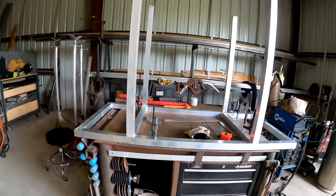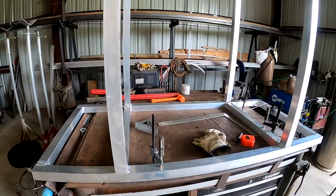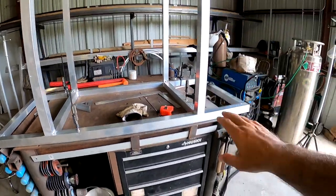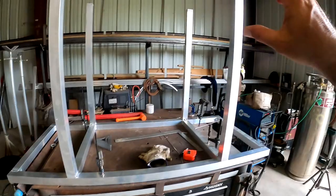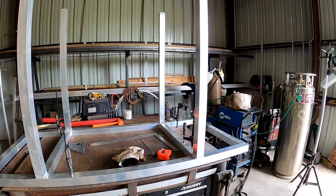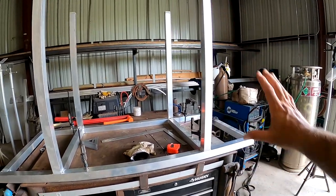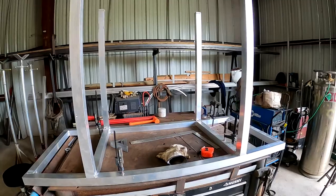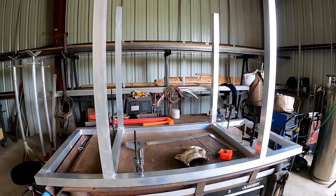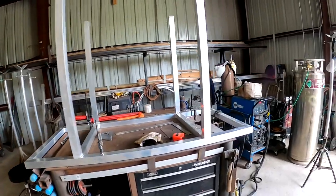All right, I'm gonna go ahead and measure and cut all these braces in here for that up there, and then I'm not gonna weld out the bottom until I get them braces up there. And I might not even weld it out until I tack it up better. But once I get the plate on there, that way I know for sure I don't start welding on it and it draws really, really bad. So, okay, I'll be back in a little bit.